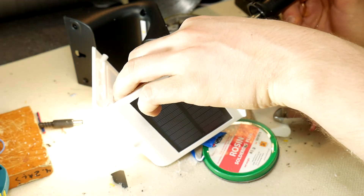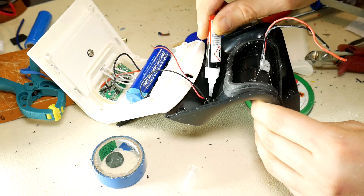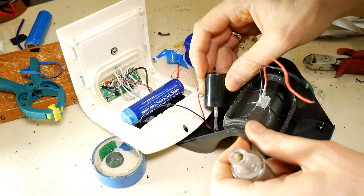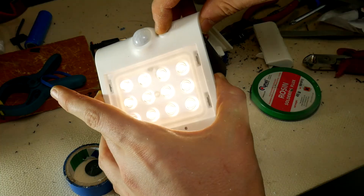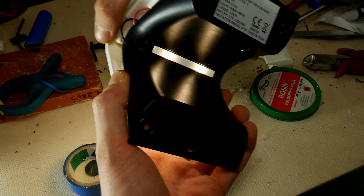It's actually alive! Also put tape on this contact for safety. Using glue, isolate the new charging socket to stop any humidity from flowing inside. Using nail polish, cover all contacts to make sure no short circuits happen in the future. Before screwing everything back together, check if everything is okay and works. Feels good when you don't have to buy a new LED light.